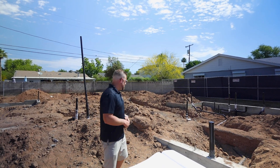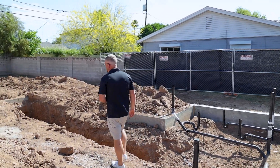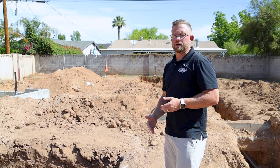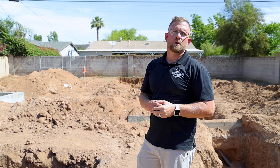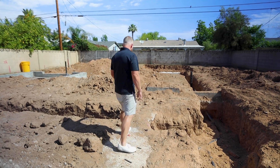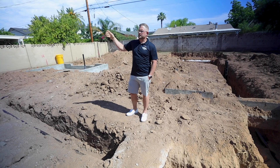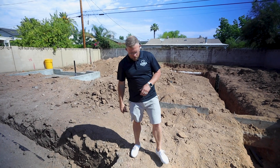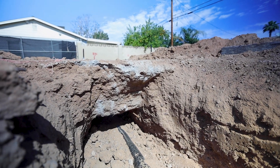One of the things we referenced in previous videos was the importance of box outs through the concrete footings. In this particular detail, we have a structural load running along this interior footing, but we have a ton of plumbing located in the front of the house. Our sewer tap is located at the back of the property, so we need to maintain a quarter-inch drop as we run through the east side and connect all of our west side plumbing — water heater, washer and dryer, kitchen space, and powder room — flowing underneath this interior footing. We created a box out in the footing detail that allowed us to run our plumbing appropriately through the space.